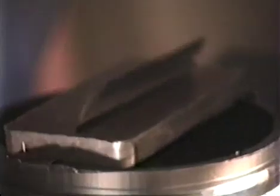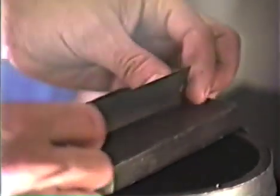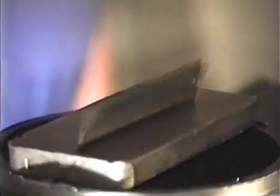Now, explain how the 60 hertz is put in that magnet. With the magnet at its natural resonance, which for this magnet is 12.5 hertz, the triggered circuit puts in spikes of 60 hertz through the large coil, triggered with a certain RC time constant discharge determined by the capacitance and the resistance. You can feel the spikes. That impresses the 60 hertz into the magnet itself as a permanent memory.